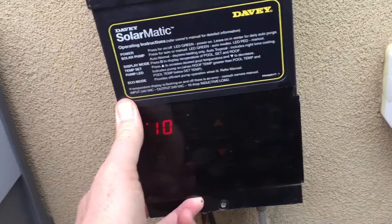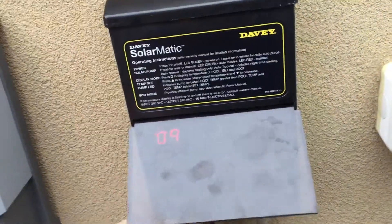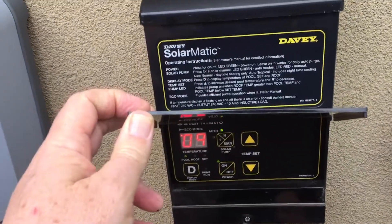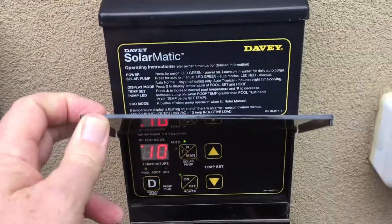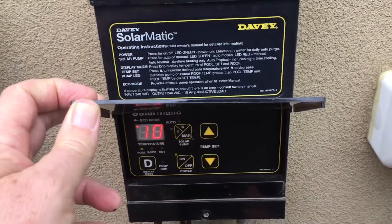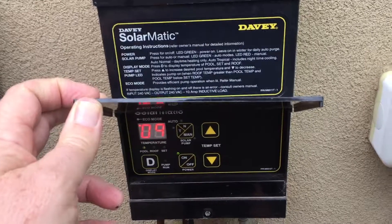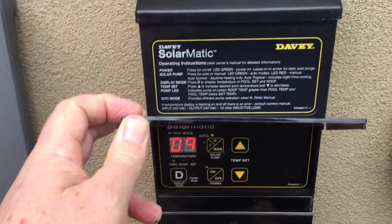When there's a differential temperature between the swimming pool and the solar sensor at the pump, it will run the solar — so whenever there's potential from the sun to heat your pool, this will turn on and heat your pool. If you're doing it manually on a sunny day, you might get periods of cloud or the sun goes away and you won't turn it off quickly enough, and your solar will actually be running and cooling your pool. With a solar controller, it'll always pick the maximum efficiency — if there's potential to heat your pool it'll turn on, and if that potential goes away it'll turn off, so you won't be pumping water up onto the roof and cooling it down.